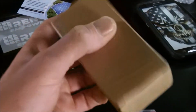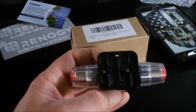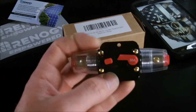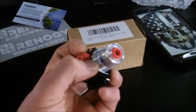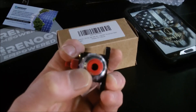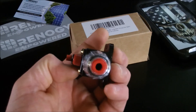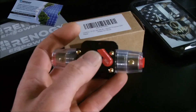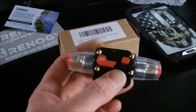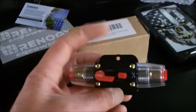This is the box they come in. It's going to be right by the battery bank — seemed pretty nice. Make sure you get the right gauge when you order these fuse holders. This one has a small fitting insert — I'm running six gauge, so I've got to take that out since it's for smaller wire. I don't know why you'd want to go that small with 50 amps. I'm going to make another video on the installation when I do it.